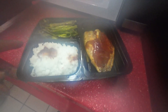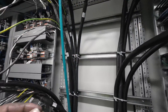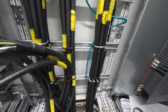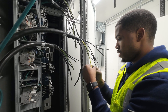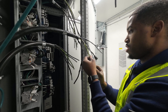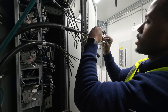Going to the list real quick - about to eat my food. Had some fish, rice, and asparagus. Now it's time to get back to work. This is how it looks right now - I think it looks really, really nice. We still hadn't terminated everything because now I have to label all of the phases of the wires so that they can match the other side of the disconnects. This was very time consuming - we had to make sure all of the numbers were going to the correct phases: the ground, phase one, phase two, and phase three. We also had our communication wires to label.